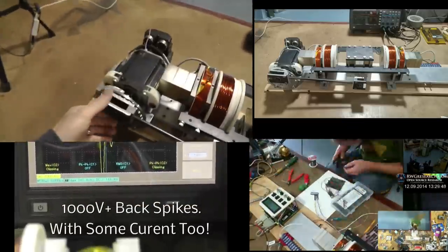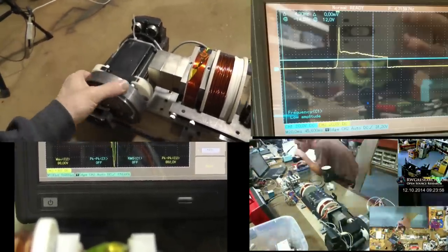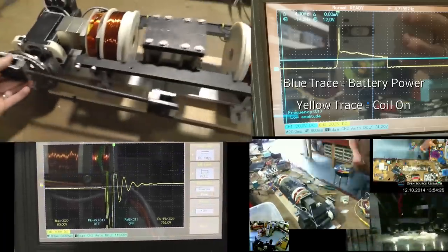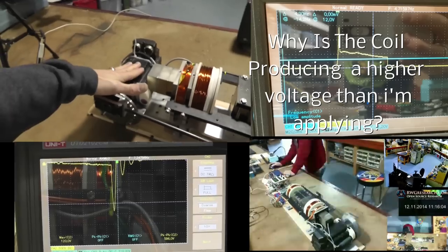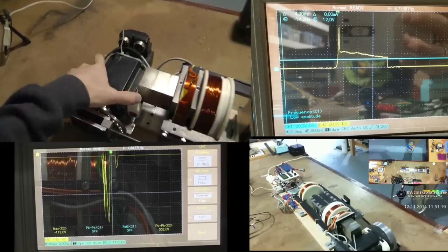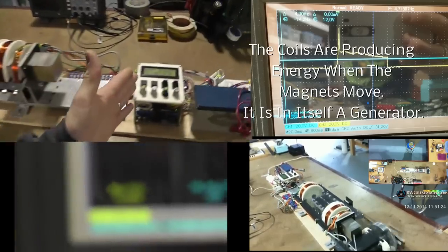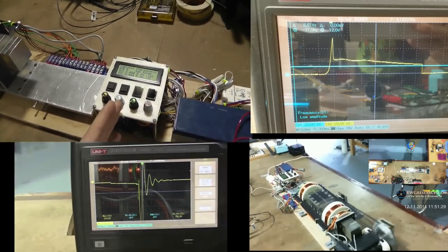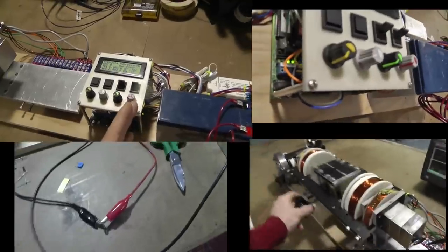Over here I have a huge lead weight that I machined out of a chunk of lead, and a reflector on a wheel, and your cam connected here. This is an Allen Bradley servo motor. I can pull power off this and charge batteries, but I'm not currently doing that. Then I have two trigger photo eyes. These two trigger photo eyes are triggering a pulse. When I pulse it, each one of these timers is a trigger delay, neutral mode on, how long, top dead center, how long, and then over here is your push mode on.